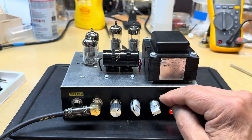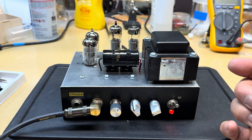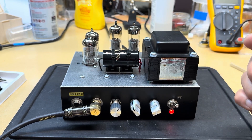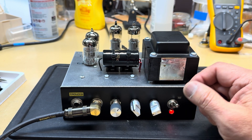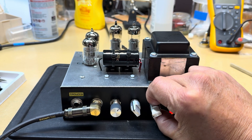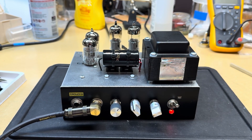To get a little extra gain and distortion — the max of this design, which is by no means a high-gain amp but you want to be able to practice stuff — by pulling the tone knob out I can get the maximum gain, which basically just changes the voltage divider I set up for the reference grid on one of the stages. It gets decent and gainy.